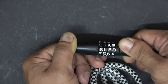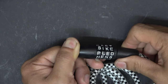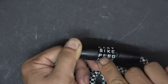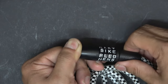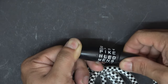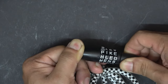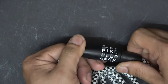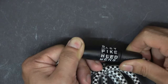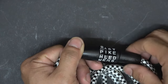every single letter moves. Now if I try the next letter, letter P, and try to pull it, okay, they all move, and there's no gap between letter P and letter L. Okay, try the next one, H. Now when I pull letter H, you can see there's a gap between H and L. Okay, see that? That means letter H does not move, whereas the other three letters move.